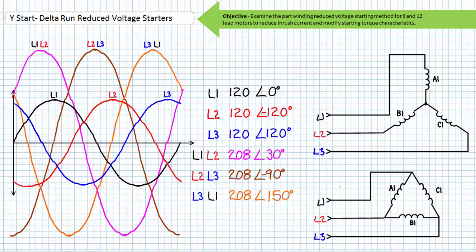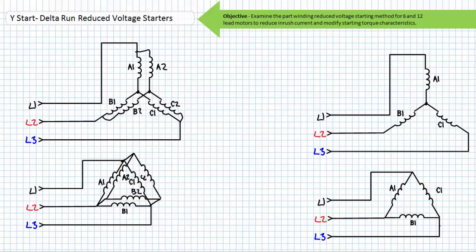Given voltage is the cause of current, a motor started in the Y configuration would therefore draw less current than one started in the delta configuration given identical windings. The Y Start Delta Run method takes advantage of this by starting the motor in a Y configuration, and then once the motor has accelerated for a predetermined period, the Y configuration is momentarily broken and reconfigured as a delta. Each winding now experiences the larger line-to-line voltage; however, given the motor is already moving rather than at rest, the inrush current will not be as great. This method therefore serves to stepwise limit inrush and mechanical stresses of the driven load.